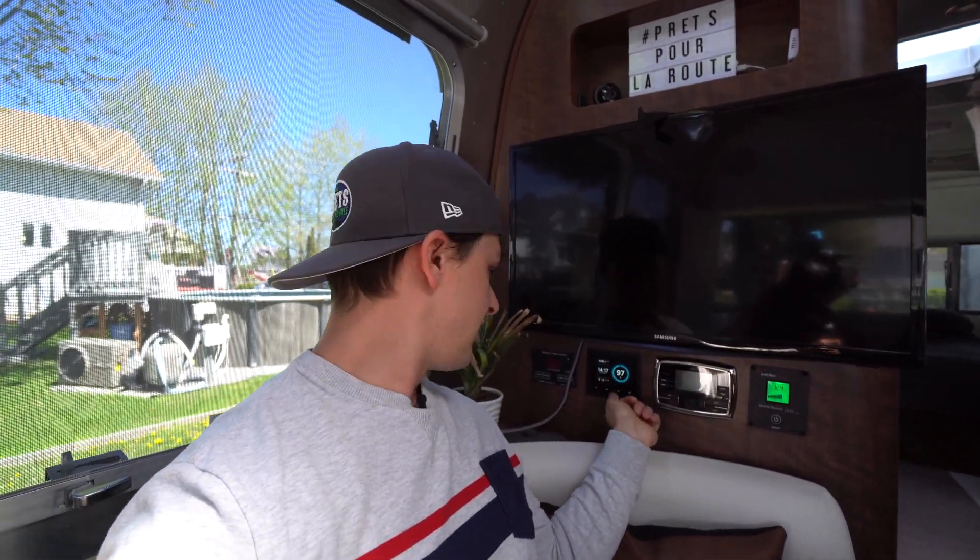With 400 amp hours of lithium batteries and 500 watts of solar coming in, my battery monitor says I can run the AC for 3 hours and 13 minutes — that's the maximum runtime on batteries alone. So yes, you can run an AC off lithium batteries, but not for a long period. For longer runtime, you'd need more solar panels and a bigger battery bank. In the meantime, I'll keep using a generator, but I can now swap my big 3,000-watt unit for a smaller, lighter 2,000-watt generator. Microair was very helpful throughout — leave any questions in the comments below. Thanks for watching!